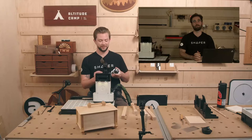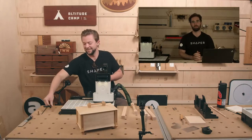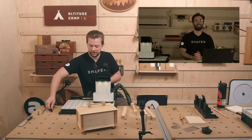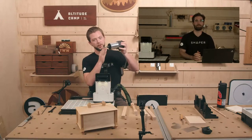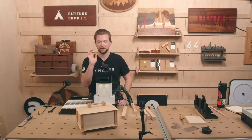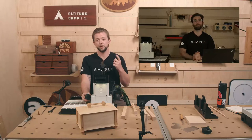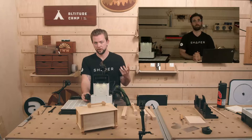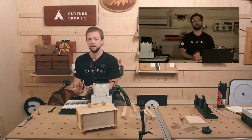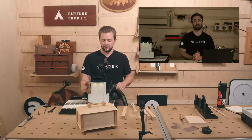You may not know that our buddy Goose, who operates the switchboard, is also an esteemed graphic designer. He just informed us this afternoon that he ordered all of the labels today — so it's real. I've got this monster chucked up nicely. It's also great when you chuck it up in the collet exactly where it tells you to — it hovers just about 2mm above your surface, so it's like the perfect length. You're getting the maximum. You can actually cut a little bit deeper with this bit, but the flute length itself is 36mm, which I like for my finish cuts, engaging the full flutes. And 36mm, for everyone watching from the States, is about an inch and a half — just a little bit under. So for this inch and an eighth leg, it's going to be more than enough.